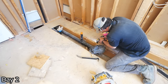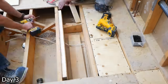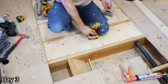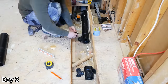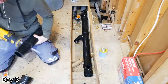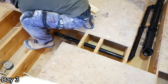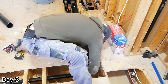The toilet is going to have to be extended down a little further. Because of our clients' needs, they wanted that walk-in curbless shower, so the steps are opening up the subfloor to be able to recess it — I will be coming out with a more in-depth video on this exact topic. We're taking our existing toilet drain and extending it out further to get to the new toilet location, and then coming off of that with our shower drain as well. Both are being vented up in the new wall we're building, where they'll later be run into the attic and tied into the existing vent. And this here is just the shower drain being brought over to where our new giant walk-in shower is going to be.